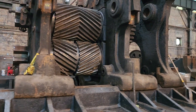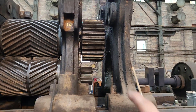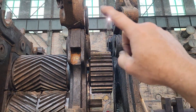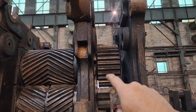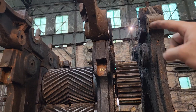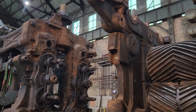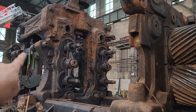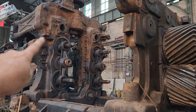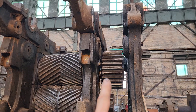We're going to try on Monday to put in the train of gears that go up here, so they transmit power from that large spur gear up to the horizontal shaft that runs the vertical rolls through the bevel gears.